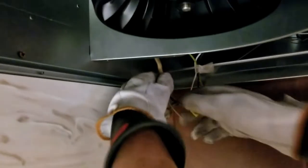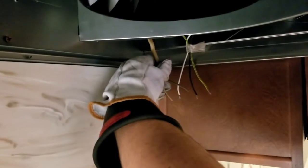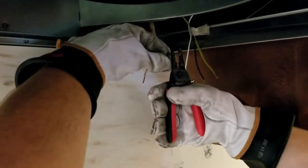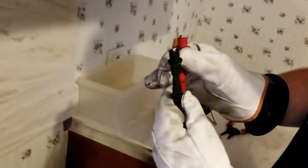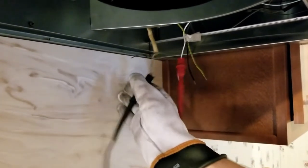First thing, need to trim back so we can get the wires exposed. Remember, this is live — there is power here. Normally you don't do this unless you take power off, but we're not sure which breaker to go to. So first strip back wires, make sure they don't touch. We'll put these little clamps on so the meter always reads while we swap breakers.